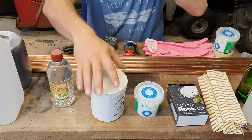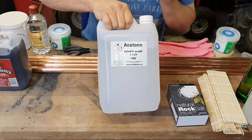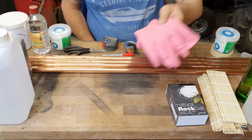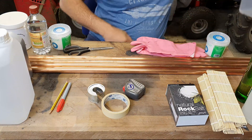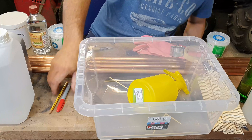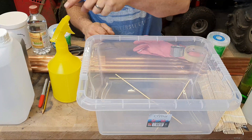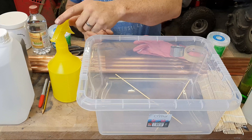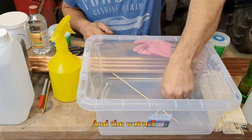To clean the metal I'm going to be using acetone — sand it down and then clean it with acetone. I've got marigolds for handling the clean metal afterwards. They're all going to go into these containers, and I've got a separate spray bottle for each one. Next week we're going to do exactly the same solutions again, but this time we'll dissolve as much salt as possible in the ammonia, the vinegar, and the water — and see if that gives a stronger patina.